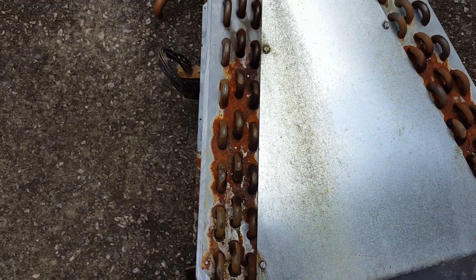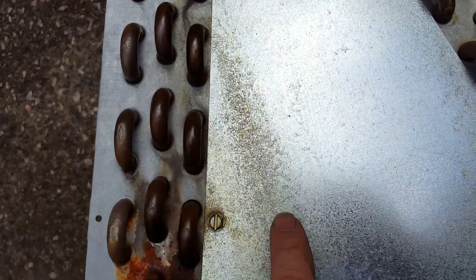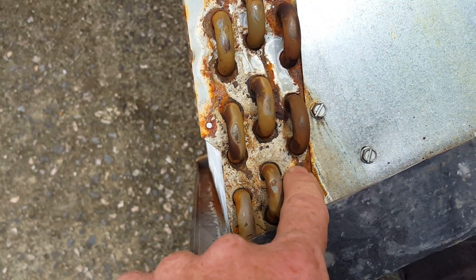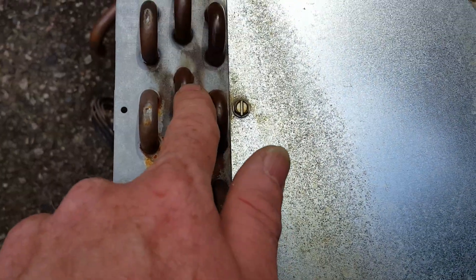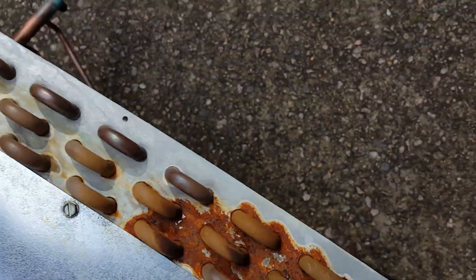This is for looking for visual signs on a leaking evaporator coil. We have our visual telltales — the glossiness here on the leaking ones, plus you also have the oil streaks, as you can see right through here. This is where the oil was streaking down. You can clearly see the difference where the oil was versus standard water and rusting. You can see here where this one had been leaking, and it looks like somebody had previously put some sealer in. You can clearly see where this is a telltale — formic acid eating away at the copper where it's all glossy like that. So that's one of the telltale signs, and this is on the backside.